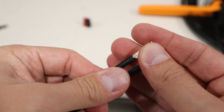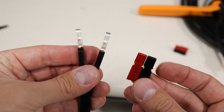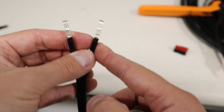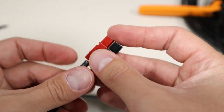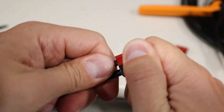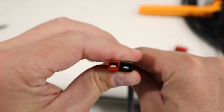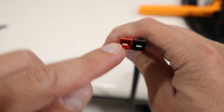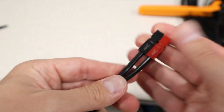Let's go ahead and see if we can slide the connectors on now. So we have our crimped contacts ready — this side is the bumpy negative side. You just take your connector, and sometimes it's a bit stiff, and they click in. You'll hear a click. You can see they clip over the little metal piece inside, so now it won't come off. Now if you ever have to remove these or you mess up, you just take a little screwdriver and pry that up and then you can pull it off. That's one side connected.